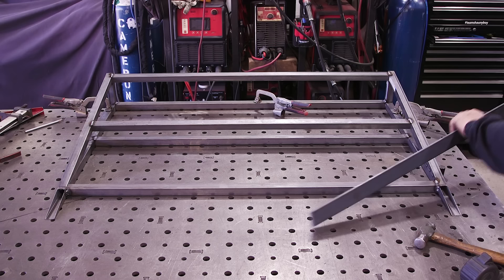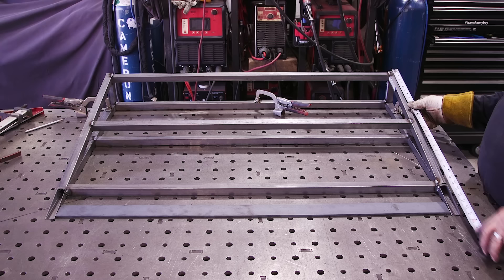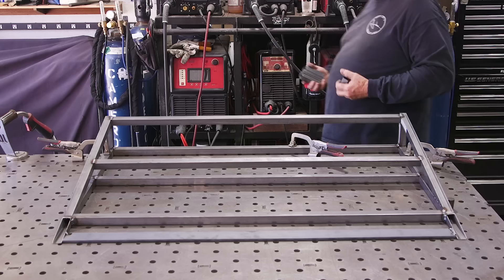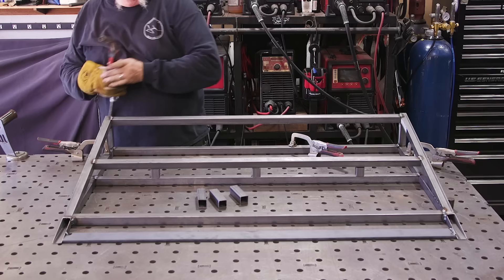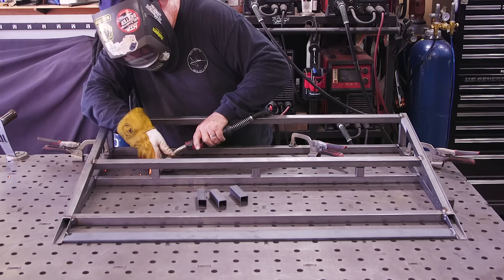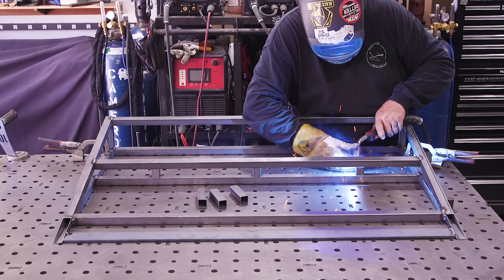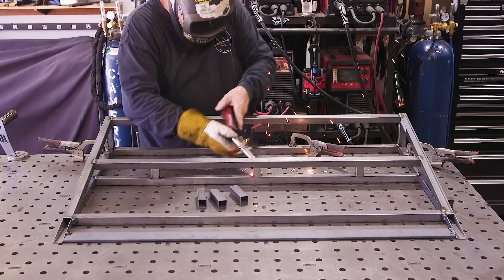I got a piece of flat bar going on the very bottom — it's going to be sitting on that concrete stem wall, and the front part of the sheet metal is going to protrude over the front edge about an inch and a quarter all the way around to lock everything into place. I'm getting the dimensions right and then decided I better add supports in the middle too. It's pretty wide, so just those cross supports weren't going to be enough. That outside edge is going to be sitting on top of the concrete stem wall.